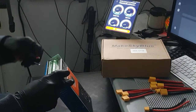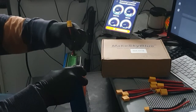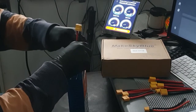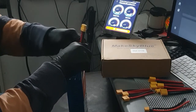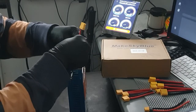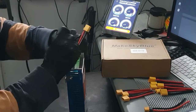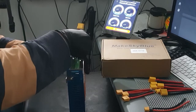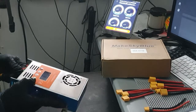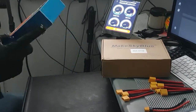I'm actually waiting for an inverter. The inverter that I have keeps surging when the refrigerator and stuff like that comes on. I have another one coming, and hopefully it's supposed to be in today. That's a 4,000 watt inverter, 6,000 watt surge, so hopefully that would take it.